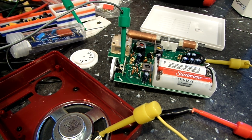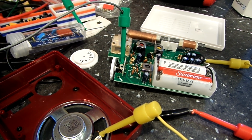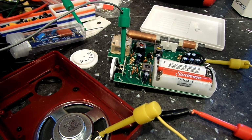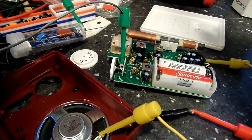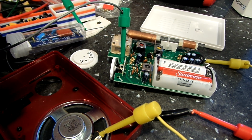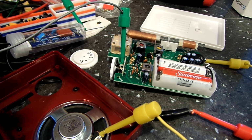Hi, I am back once again. Like I said, this is the 2P3. I've done some checking, and I used the signal probe Bob developed, and I managed to put a signal into the volume control and turn the volume up all the way, and I'm barely hearing any kind of noise out of the speaker. Besides that, I took the BDST and probed the same spot to see if I was getting any radio signals through, and I'm not getting radio signals either.